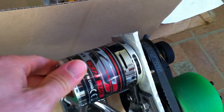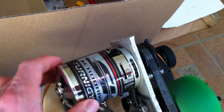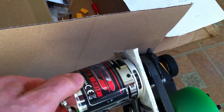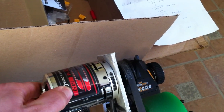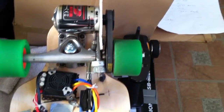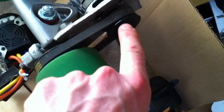Here's the motor — this was recommended on that blog. It is a Turnigy 6374 model, 149KV. That KV rating means RPM per volt, so it's voltage times 149 which gives you your RPM. All those calculations are available online.